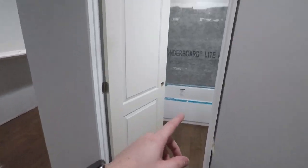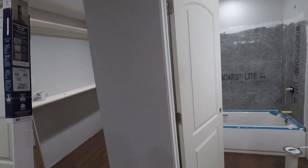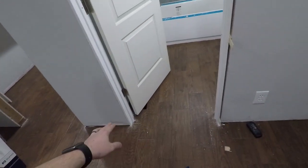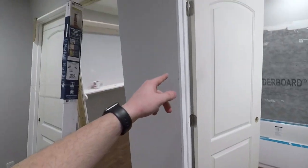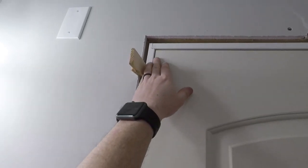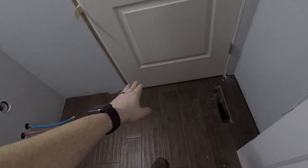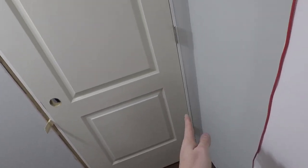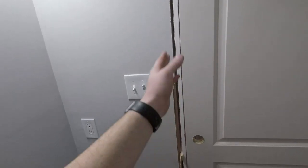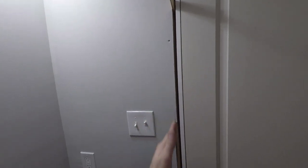Ended up having to put four blocks on this side. I added another one here because it was kind of warping in a little bit, which you can check with a long straight level. To recap: make sure the floor is level; if it's not, figure out how much unlevel it is and cut that off of the high end; make sure the jamb is in straight; screw it in; then check the gap. When you close it, the gap at the top is perfect — that gap is set primarily by a level floor and secondarily, but just as importantly, a level side with the hinge. If this side is bowed way out it will affect the top gap, but that's primarily not a concern if you're checking the gap and it's pretty close.